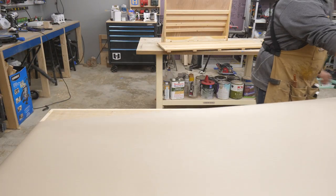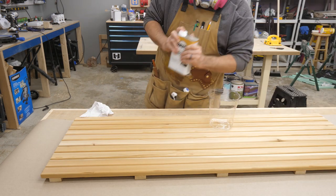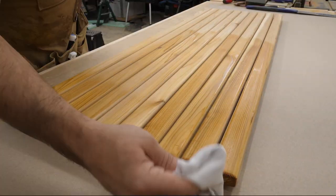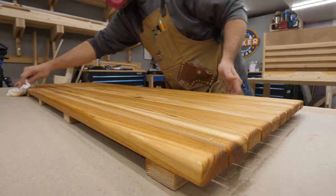Finally I got to start finishing it. I pulled out some paper and grabbed a can of tung oil. I found several recommendations for this stuff online and it worked beautifully. It helps protect the wood from water but will need to be renewed each year, which I'm fine with. But look at that finish — so freaking pretty.